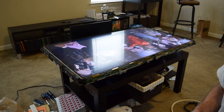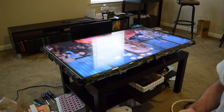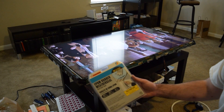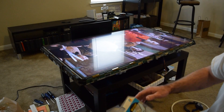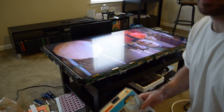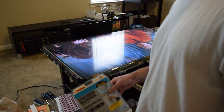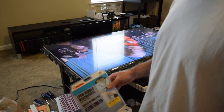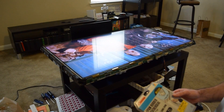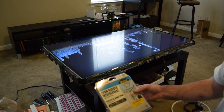So we're going to go with just applying mechanical pressure to maintain contact. What I did is go to Home Depot and get some rubber weather seal that's adhesive-backed. It's going to go across the top of the connector so that when I put the frame on, that pressure is mechanically maintained, which should keep the contacts firmly in place and allow the TV to operate without any intermittent issues.